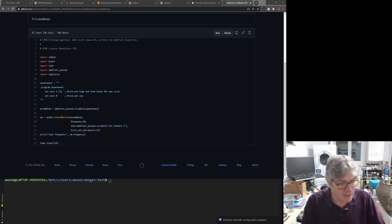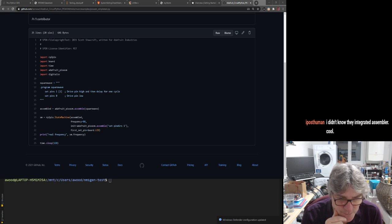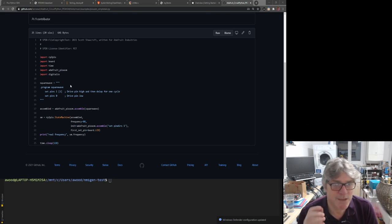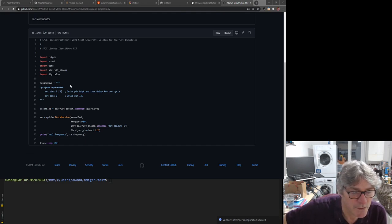So from within CircuitPython, you can directly assemble. All the assembler does is create the binary codes that are necessary. When you do that in the SDK for the Pico, it creates a C header file that you import, and you can then, using the C/C++ SDK, copy those bytes, actually 16-bit instructions effectively, microcode or nanocode, to the correct register inside the RP2040 to store the program.